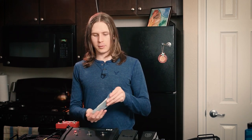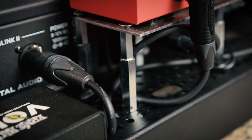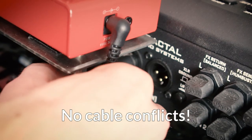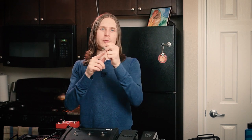Here I have some standoffs from Digikey — these are spare M5 ones. I'll leave a link in the description so you can buy these and know they fit. Digikey is great, but it's also really tough to find things on there, so I'll give you the link to exactly what you need. It needs to be either 40 or 45 millimeters high. I did it in two pieces, but you could do it with one piece — the two pieces was a little more flexible for potential future mounting situations. Digikey is great, but it's going to be really hard to find a washer and nut of the proper size, so I'd recommend going to Ace Hardware and taking your standoffs with you to check which washers and nuts fit. You'll need four of each part — four washers and four nuts — then you can screw it all together. You could probably do this with plexiglass as well and it'll be really rock solid.